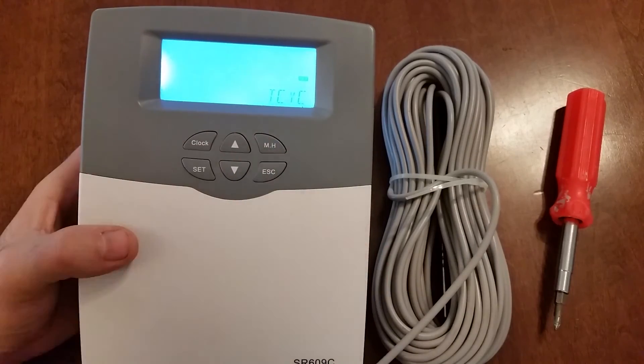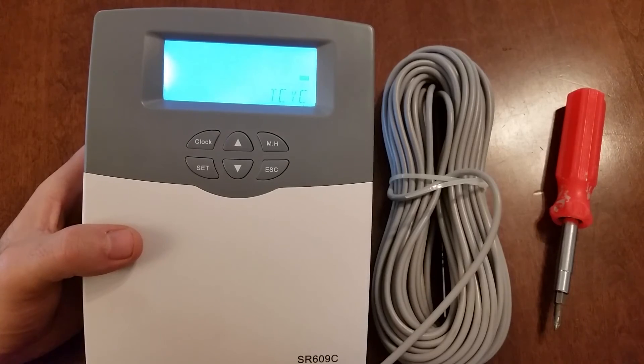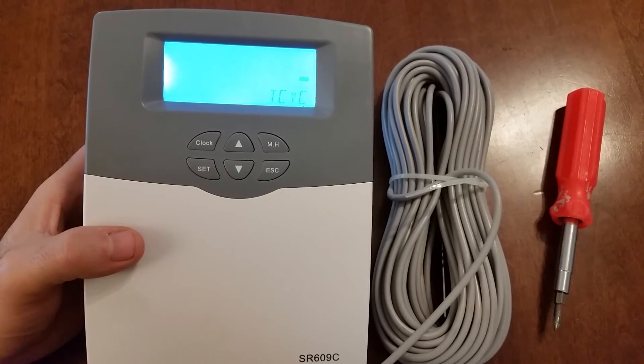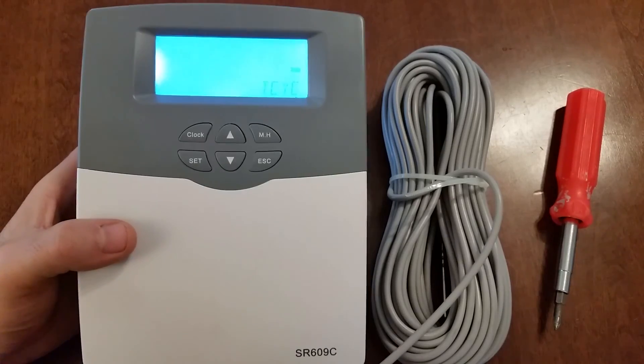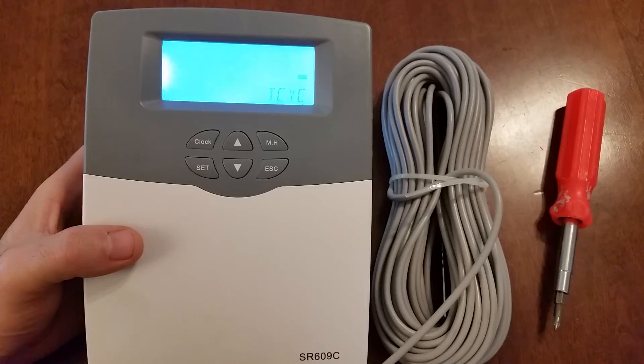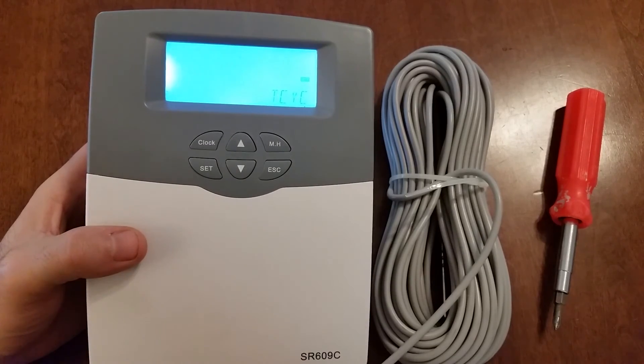The other feature you'd want to know about is the timing function — you can actually turn on that R1 relay with just a timer. This is a good freeze protection mechanism for the winter. On really hard freeze nights, even better than letting your faucet drip is having this turn on for five-minute intervals or less in the middle of the night, just to cycle a little bit of hot water through those pipes. You're only worried about the bit of pipe between the tank and the conditioned space.